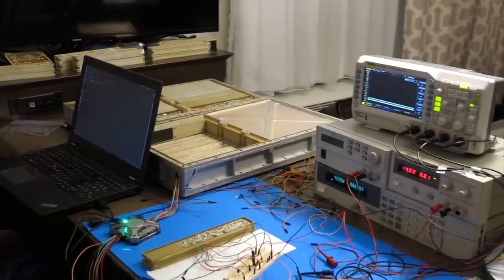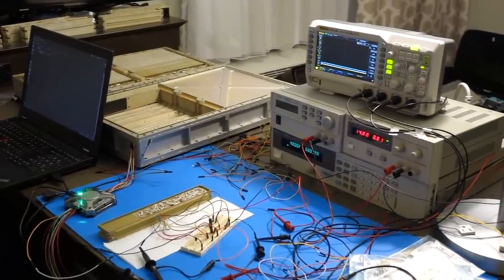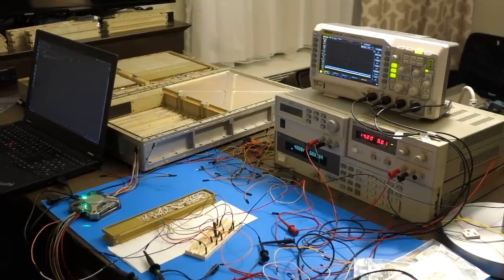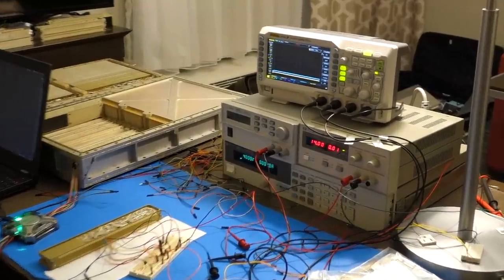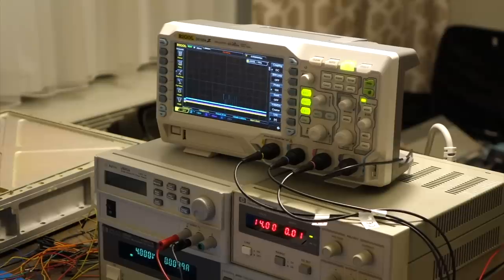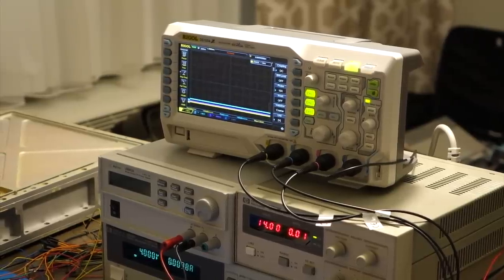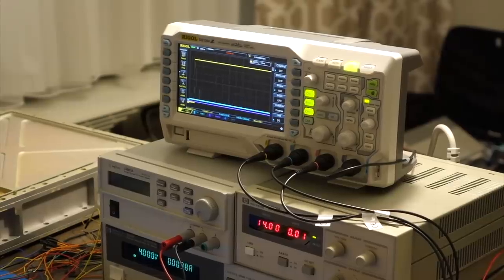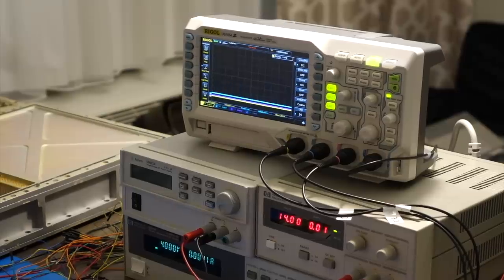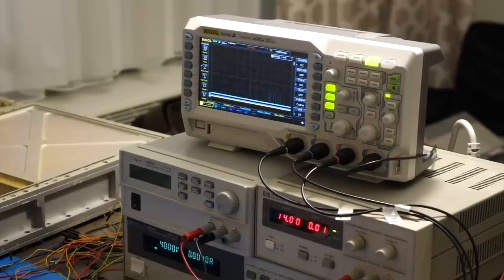So it watches for restarts, dropped counters, scaler double, a voltage failure, so all kinds of little failures. And then actually you create some, right? So I create a few. There were three, it was fine. And then you made four, and whoops, it went, oh, no, that's no good. That was one time too many. Then it went fine again. They don't have to be consecutive. They just have to be enough of them in a short enough period, which is kind of arbitrary.